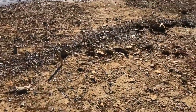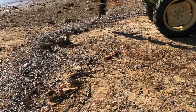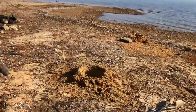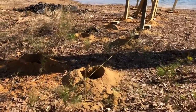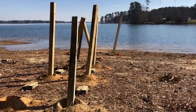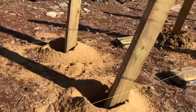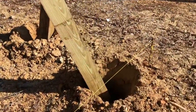We're going to have two for our floaters down here as well, and we've got our post-hole digger ready to roll. We've got all the posts dug and I'm starting to lay in the poles. I've run a string from the rebar as you can see, and that gives us a guide of reference to keep these things lined up.